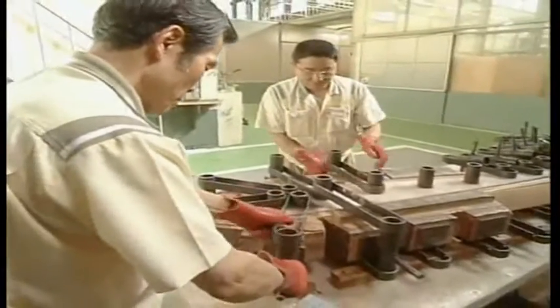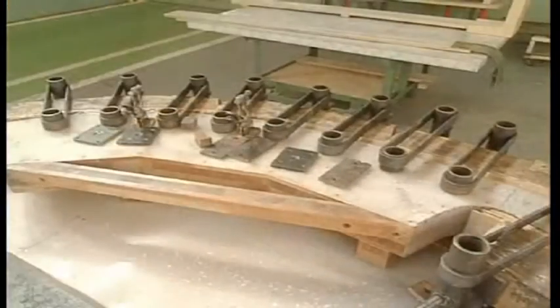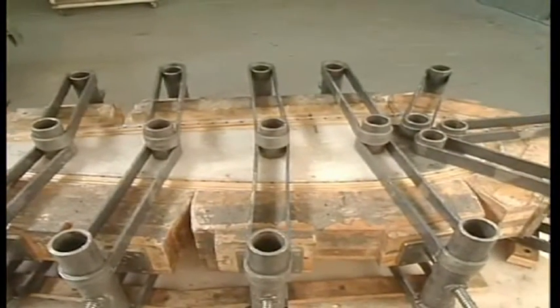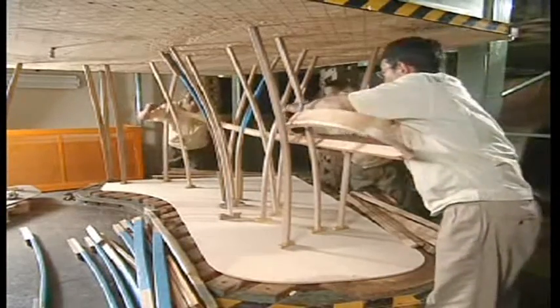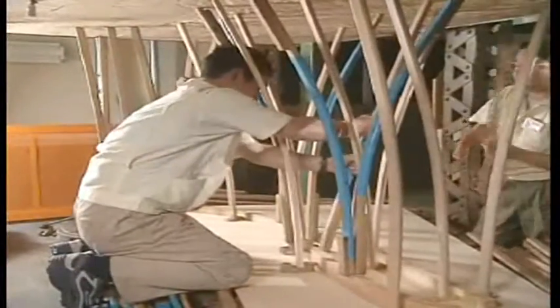The grain of the wood is also aligned end to end along the curve of the bridge, resulting in better sound balance and smoother transmission of tone and power. The bridges are then bonded to the soundboard on a special work table called a tsuzidai, using the same method as that for bonding the ribs. The craftsmen press the bridges using subtle hand control that cannot be reproduced by a machine.